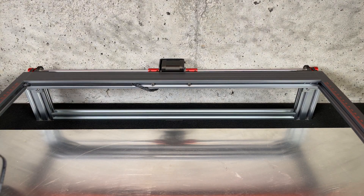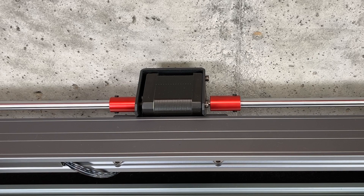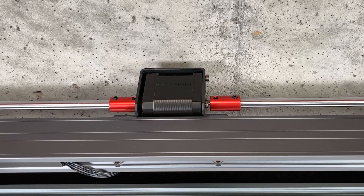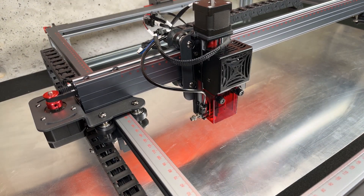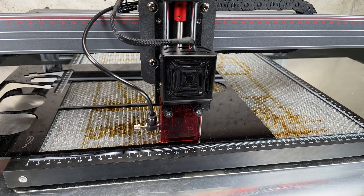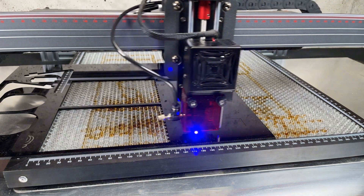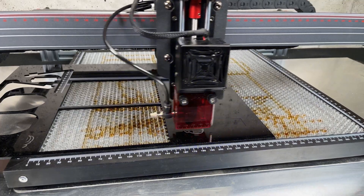The third great feature is the fact that both Y-axes are linked. We often move the laser head around, and on many lasers only one of the sides is connected to the stepper motor, making it easy to misalign the sides. If you ever have to redo a cut, the machine will match on one side but you'll end up with double lines on the other side.